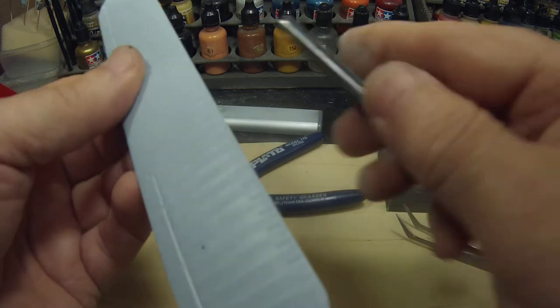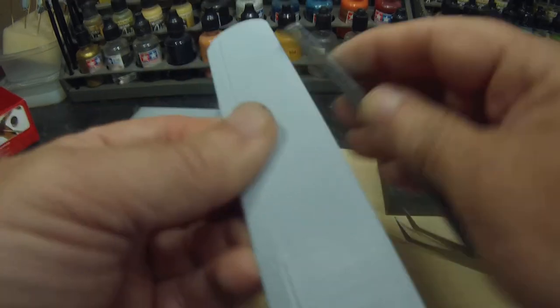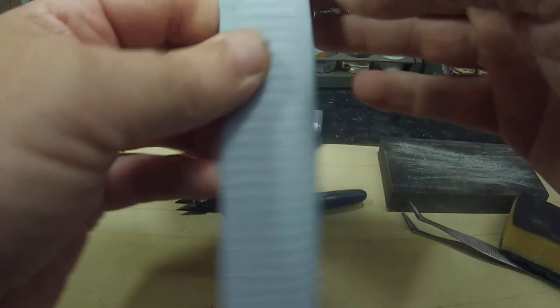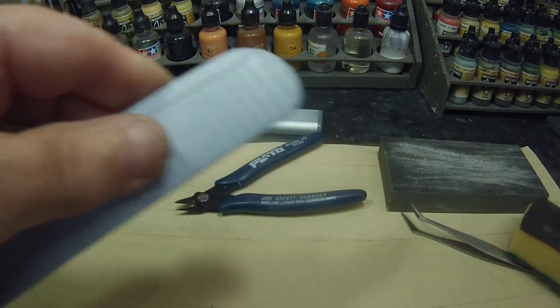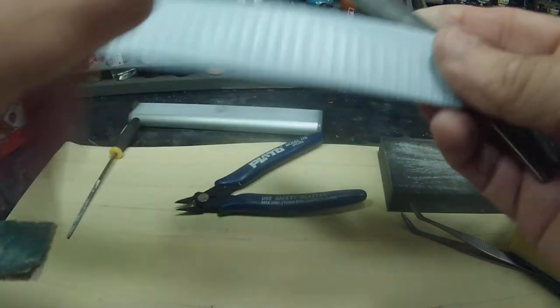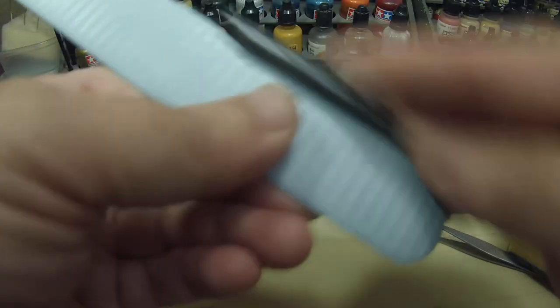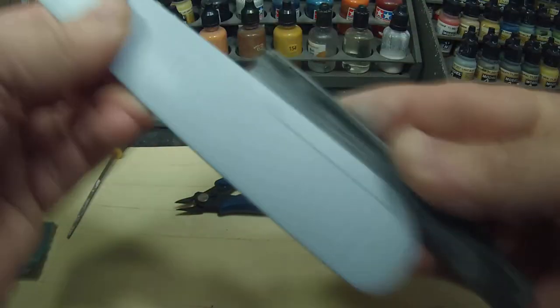Got a little bit there in the center. I think it's a sprue entry. I think I keep knocking the camera here. Oh, that's better. So that's basically what I do. When I join two wing halves together, which I don't need to do here, the glue normally oozes out, so I always use this method to remove any glue that's oozed out from the gluing process.